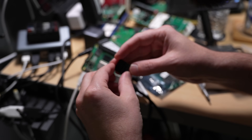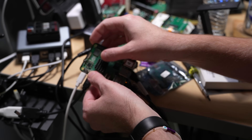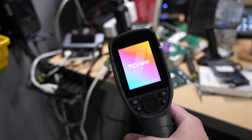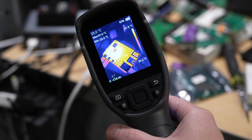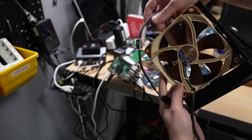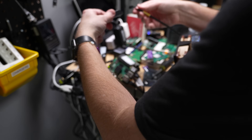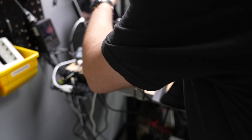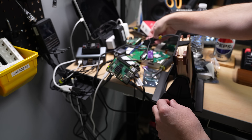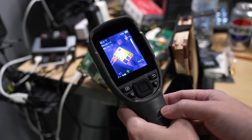It's getting a little hot, so I should at least stick a heat sink on here so it can dissipate some heat. Let's check how hot this thing's getting — I might want to put a fan on it. Yeah, it's getting a little bit toasty, 70 degrees Celsius or so. So I put a fan on this — it's a 3D-printed shell for a 140mm fan with a 5V Noctua fan. Now we're in business. 60 degrees — at least 10 degrees off. I think we're not throttling anymore.